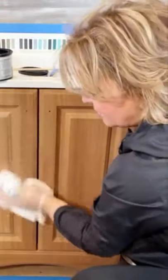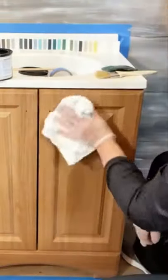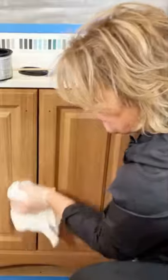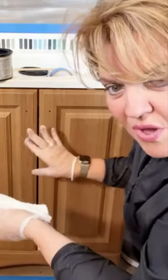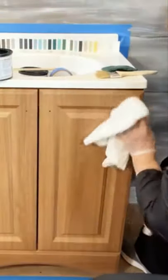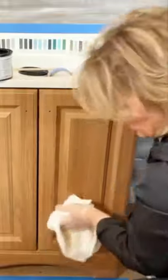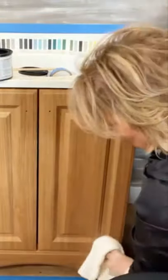Clean towel going there. This is brand new, so let's talk about that. This just came out of the box, but that doesn't mean that it's clean and ready to paint. It has a silicone, and that's a mold release that's put onto new surfaces. You want to be sure and get that off. That is equally as important — it's also considered to be a grease, and it will prevent paint from bonding, so you want to be sure and wipe that off.